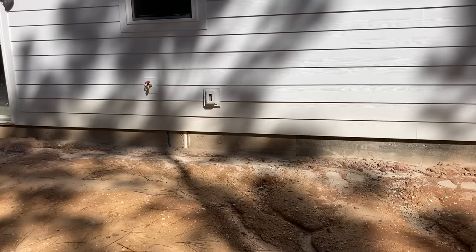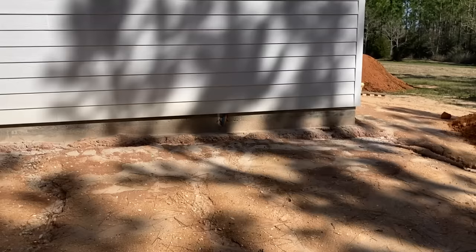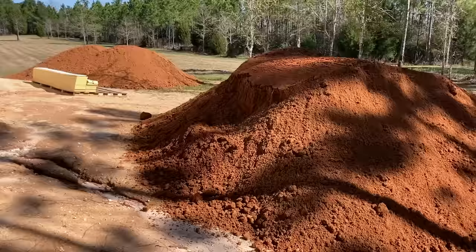I'm going to avoid filling in there. The code is eight inches below the hardy board — you should have six inches of foundation showing and then about two inches for sod. I have this big pile of fill dirt and it looks like it's got a lot of clay in it.